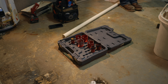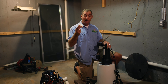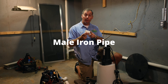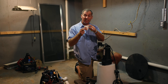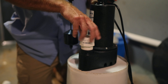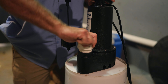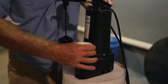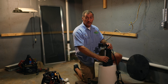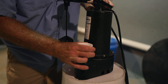We've got the discharge pipe completely cut out of the way. We have our new pump and an inch and a half MIP adapter. MIP stands for male iron pipe — so male iron pipe by PVC. We're going to screw this adapter down into the top of the pump. We don't need thread sealant or anything like that, because this does not have to be a hundred percent watertight. Just screw it in hand-tight — good and snug. We don't even need a wrench or pliers.